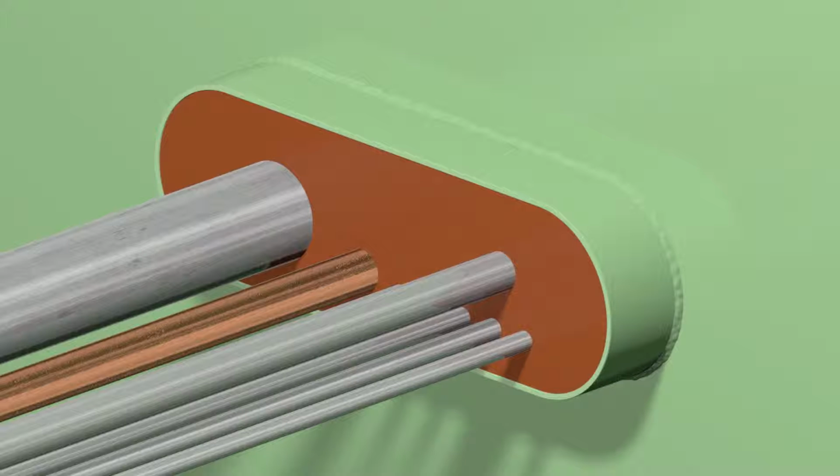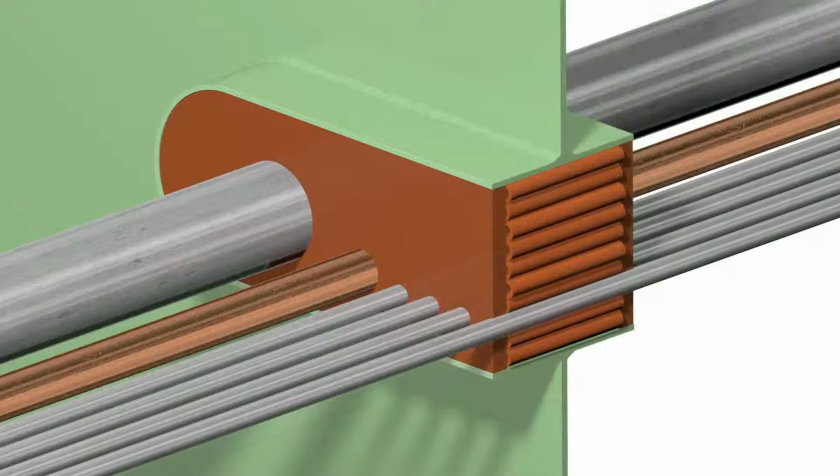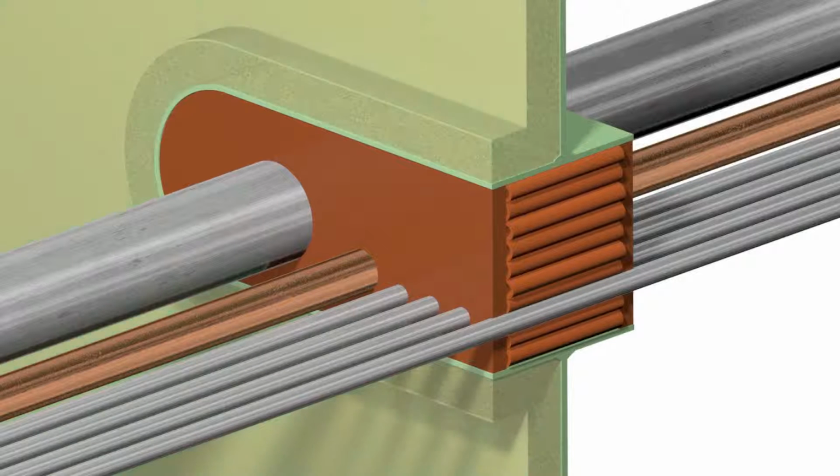For Class A penetrations, which are insulated, the NOFIRNO multi-pipe transit frame needs to be insulated only at the insulated side of the bulkhead. No insulation is required on the pipes or the face of the transit.